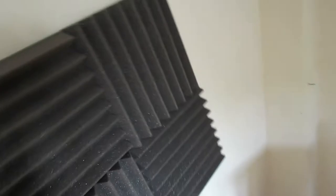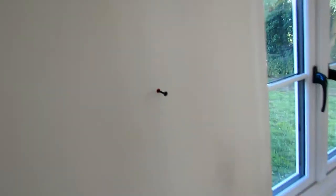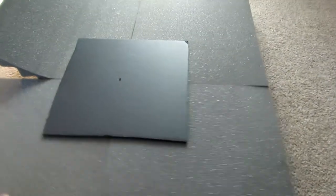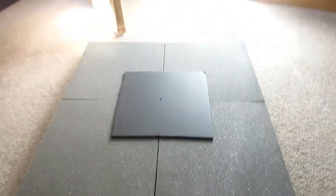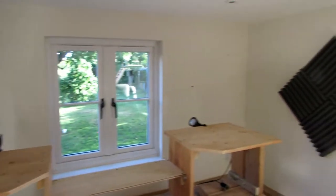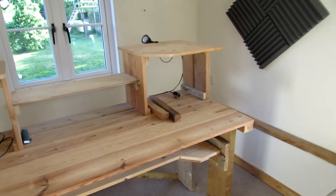Just in case you were wondering about the panels — they do move around — they're actually only fixed with a single screw and a rawl plug into the wall. For each of these sections, if you turn one of the panels over you'll see I've just literally glued them onto a piece of plastic card, and that holds four panels together. Then a single screw through the middle holds it to the wall. The only reason I'm doing that is so that if I ever need to change rooms, it's totally reversible — you won't get that horrendous thing of black foam stuck to the walls that you can't get off without damaging them. Anyway, hopefully next time I'll have something to do with music — thanks for watching.